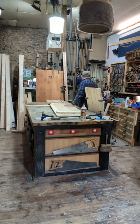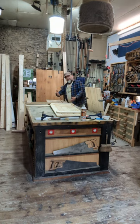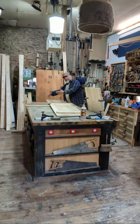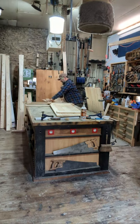The worst thing here, when I'm cutting with this saw, is that because all these other ones have got the tongue and grooves holding it together, as the cut is going through, the wood's trying to fall away, but it's holding on to the next piece of wood. So this part here is trying to break away, but it can't quite, and it can rack onto the blade. So you've got to bear that in mind.